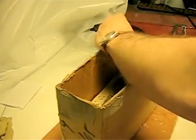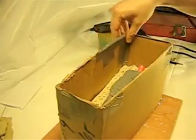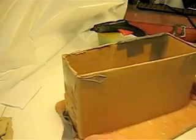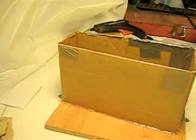It's kind of a redundant process. I vacuum my silicone anyway, so I am going to pressurize the smaller parts. I just feel safer with them under pressure. The silicone will get everywhere it needs to go. That'll be a strong mold either way, and ready to go into the tank when it's time to pressure cast.